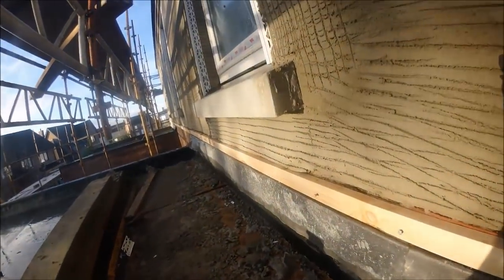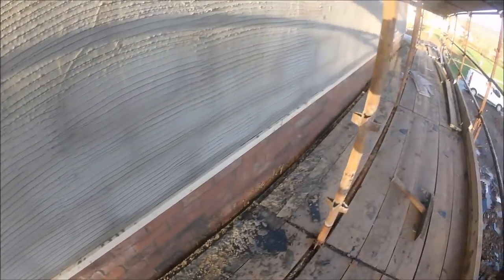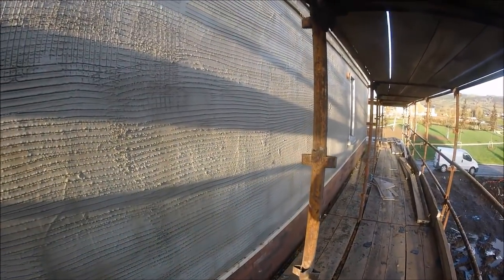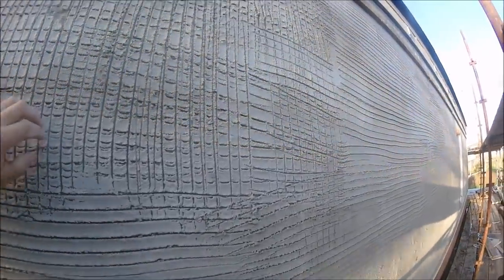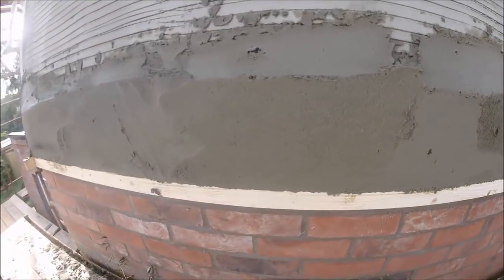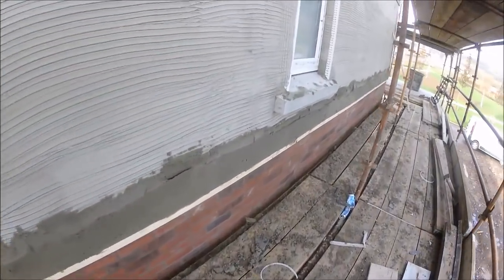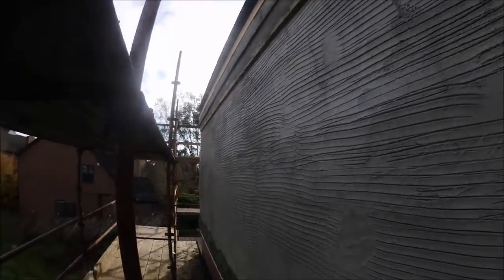It's pretty good scaffolding, but if you're working from heights always take care. You can see it's quite a long run of band. Some people might want to put a band at the top similar to what we did at the bottom and strip it off, but I prefer to cut these types of bands as much as you can — I think that's a nicer finish. The scratcher used here was slightly different from the one I usually use. This is the band on the brick all being laid on — it's quite a thick one, and the one at the top is already on and rubbed.